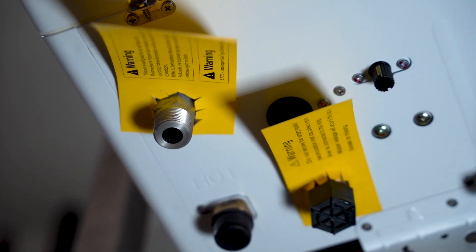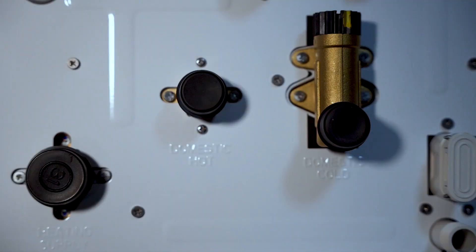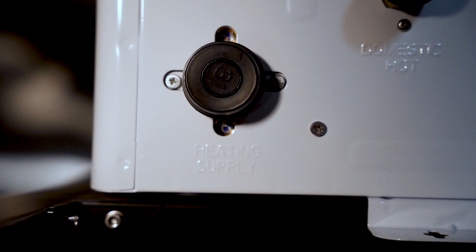On the bottom of the unit, if it's a tankless unit, the cold water inlet, the hot water supply outlet, and the recirculation inlet on the A units are all labeled. A combi boiler will also have the domestic cold water inlet and hot water outlets labeled. The gas connection is located on the bottom of the unit and labeled as such, along with the condensate connection. On the boilers or combi boilers, the heating supply and return are also both labeled on the bottom of the unit.